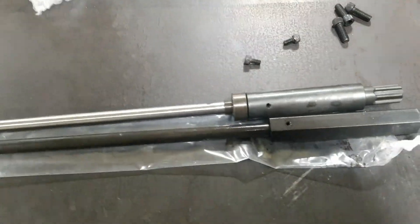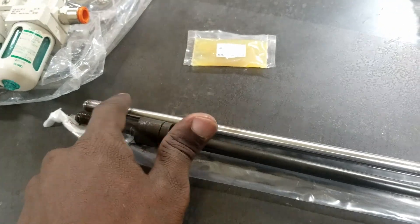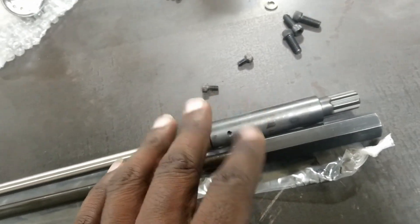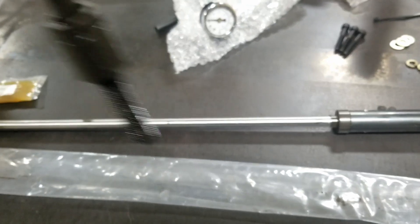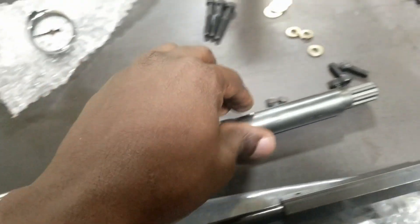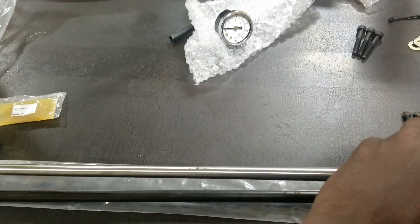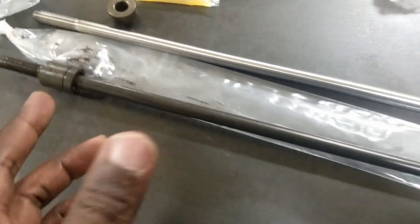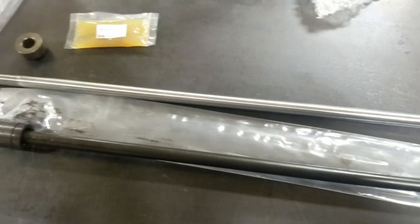For the drawbar, we have to grease some things — the top and bottom of this for sure, and maybe oil as well. This one I can grab and it won't go anywhere — it's a pretty nice fit. This other one, on the other hand, goes all the way through. So I'm going to use some grease and kind of pack it at the end so it can catch the spindle and register how it's supposed to.